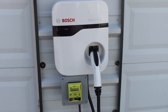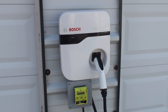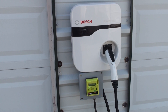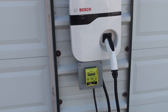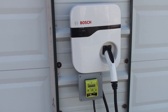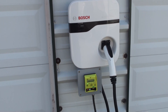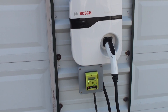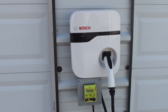You don't have to purchase a Bosch unit — you can purchase whatever charging station you desire, because all of them will connect up the exact same way. We supply the unit ready to go. You connect up your common and your load one, load two. Electrical wiring is typically number eight wire, because you're working with normally 30 amps.